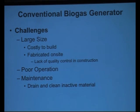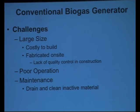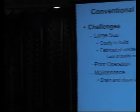And then once you're ready to start back up again, you can use some of your seed from before and reseed the reactor, but there's going to be a significant amount of time between when you start that up and when you reach steady state. Anaerobic processes are very, very slow. There could be a number of weeks or perhaps even months before you reach steady state, achieve good degradation and good gas production.